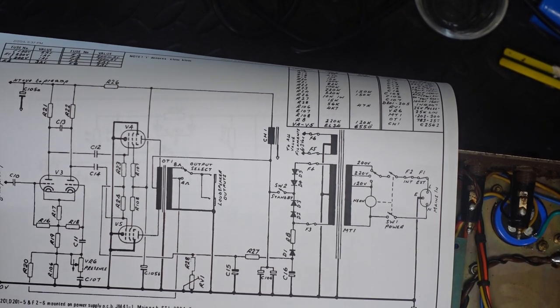Let's install these. So can we use a larger capacitor for the bias than even what I've installed, which is definitely larger? I like large bias capacitors. I'd go bigger. I want them noise-free. I want it stable. And the bigger it is, the more capacity a capacitor has to remain stable. If it's too small, it can go up and down.